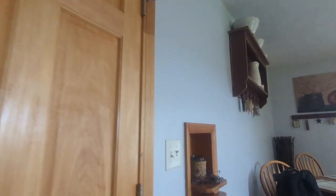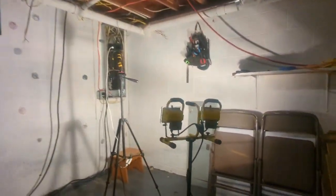We're gonna check the other bedroom. Light's still on. Check this outlet. Outlet's still good. Let's check this one. That one's still good. It probably feeds that. That one, or no, that one goes. So that one's still good. This one dead? I didn't check this one. It's dead now. I don't know where it goes. Okay, so. 3, 4, 5, 6, 7. East. Living room, and that feeds the living room and bedroom one.